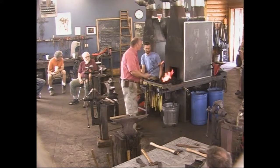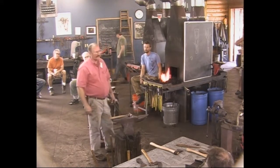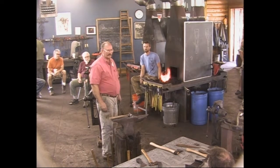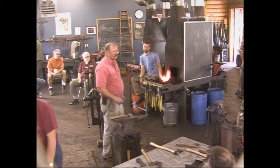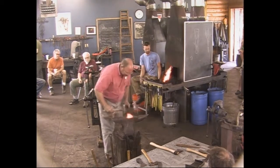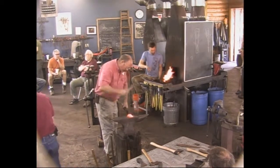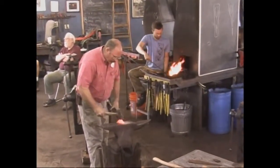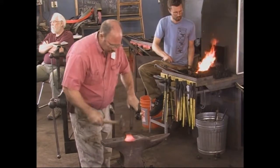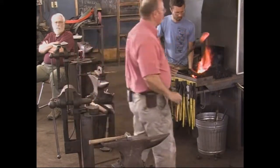And it does a very effective job, it's getting a little hotter, of the rough grinding. It is way too fast for really fine finish grinding after it's been hardened and tempered, as it'll take the temper out before you realize you've hung out a little bit too long on it. But for the rough grind, it works great. That's about all I'm going to do to the blade. We're going to flatten that next.